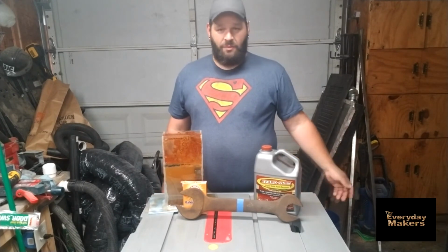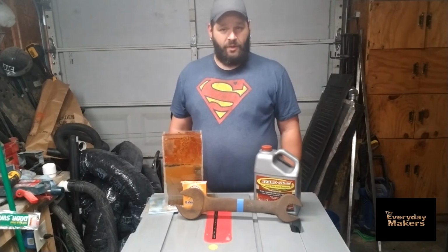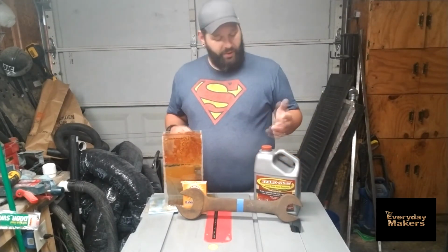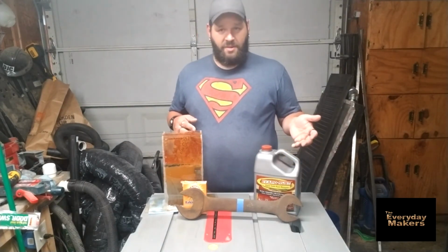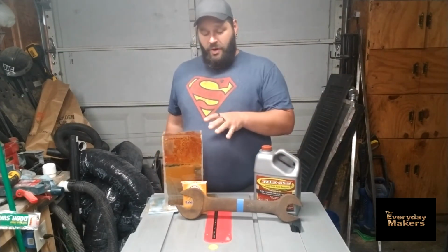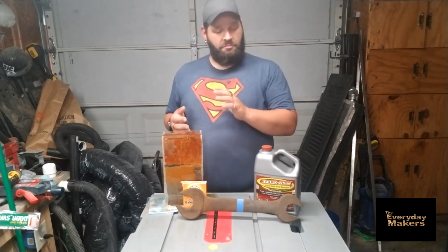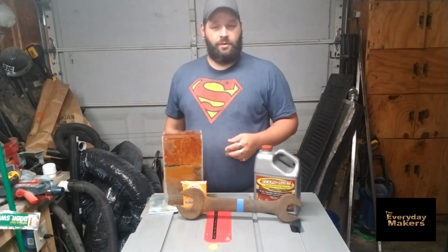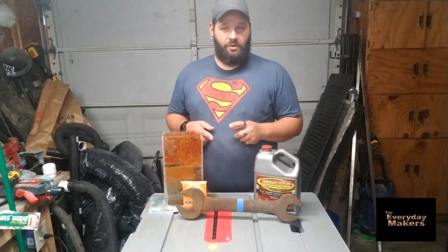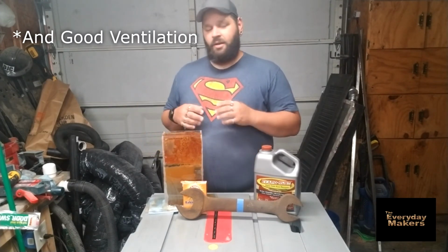I'm gonna get a 5-gallon bucket and basically just leave it in there, and when I've got something I need to clean out, I'll clean it out. Real easy. It was really, really simple. Just pour it in and let it do its thing. The electric rust method, if that is an option that you have instead of buying the Evapo-Rust, I 100% recommend that one also. If you've got the battery charger laying around and you've got a bucket that you can do it in with a piece of sacrificial metal, things like that, awesome.